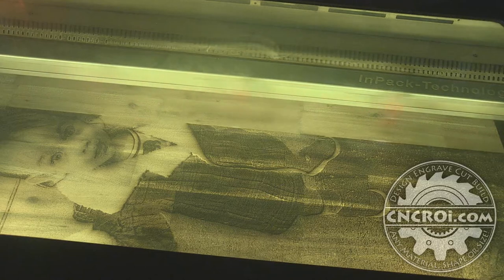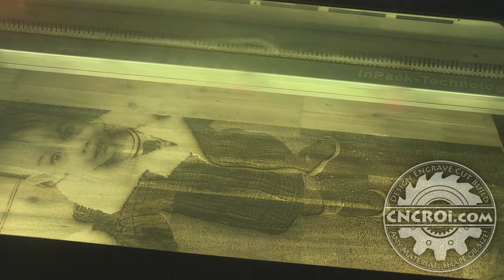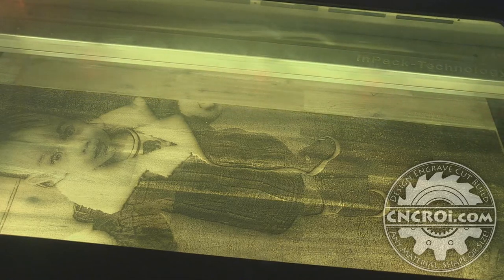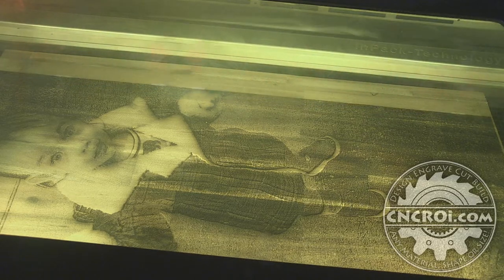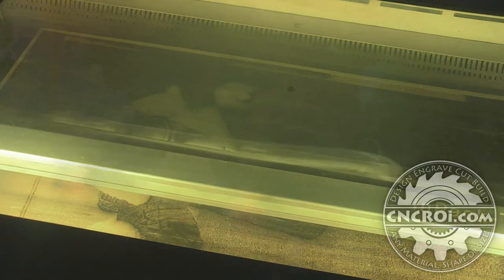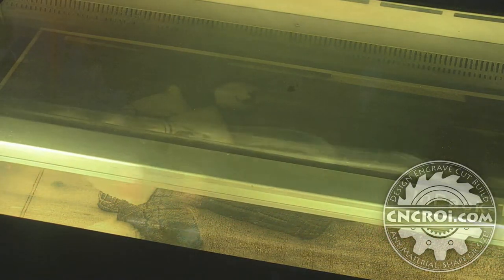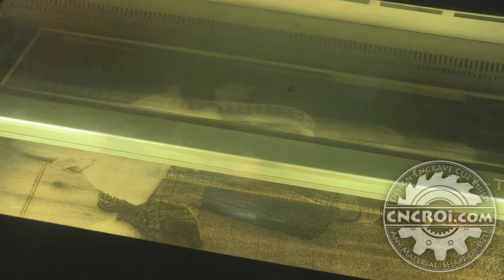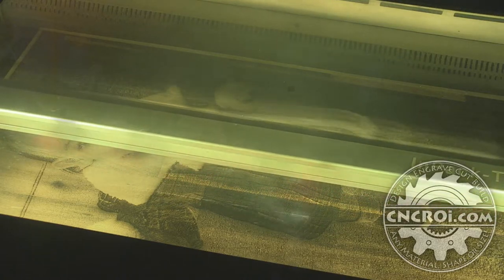The other way around is going really slow — back to the baking thing, if 400 degrees is good for 20 minutes why not do 200 degrees for 40 minutes? Again you'll have problems. In laser engraving if you go too slow you're just wasting a lot of time, and if you go the other way you're just creating a lot of charcoal that doesn't produce a nice sharp image. This one of Simon came out really really nice but it was a challenge to sand because I'm removing so much material across the surface, the center doesn't really have any large flat areas to rest on.